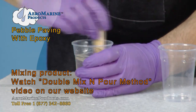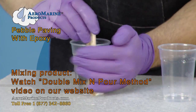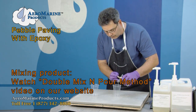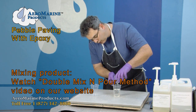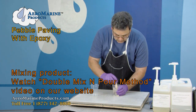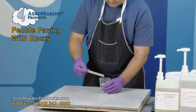In your first container, scrape the sides and scrape the bottom of the container. Continue repeating this process while you're mixing the epoxy. Transfer this mix into a clean mixing container without transferring the last few drops — you don't want that in the mix. Using a clean container and a clean mixing stick, mix the epoxy again until you're satisfied that it is thoroughly mixed.